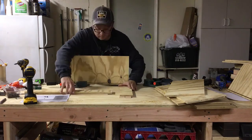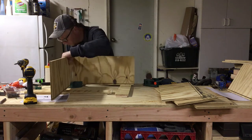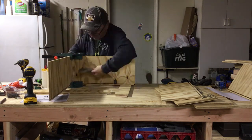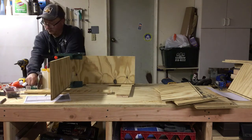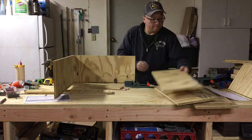Okay, so I'm putting the front in here, putting it into these corner vices, and it actually really helps hold the piece at 90 degrees. They're really amazing. They're super cheap at Harbor Freight — $9. Don't abuse them, they'll break. Terrible reviews online, but they work very well for this particular purpose.